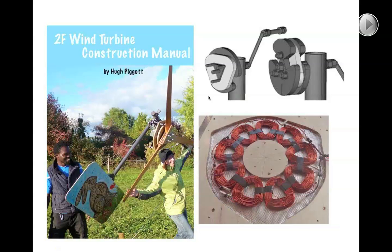It's very difficult to get a simple machine that has both good electrical efficiency and good blade efficiency, because of the very different requirements for power-speed curves. Having a bit more loss in the generator can actually enhance the blade performance. So having a super highly efficient, high-flux-strength magnet isn't necessarily the way to go to get a cheap, easily built, reliable, and overall efficient machine — ferrite magnets can work just as well.